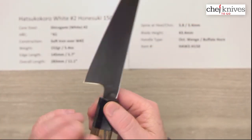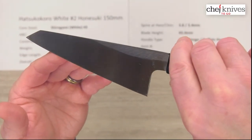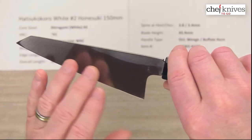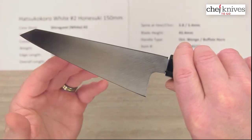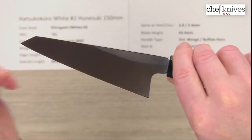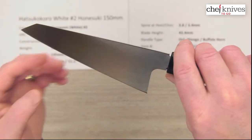And then the left side of the blade on these is slightly concave. It's known as an ura. And here's the cladding coming over the top. You actually grind the back side by putting it completely flat on hopefully a very flat sharpening stone, and you work the edges. So this helps reduce suction and such on the back with that slight concave.